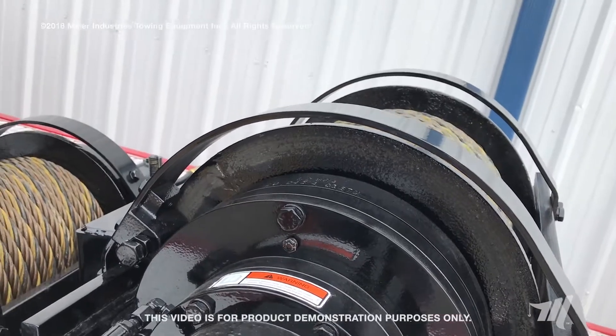Today we want to talk about the differences between the DP winch model 35 and the DP winch model 50s and how they operate internally. On the 35s, when you're in free spool mode, you're turning the gear sets through gear oil, so there's internal drag. On the model 50s, it's a total drum free spool — there's no internal drag — and therefore we have an external drag brake to help offset the lack of friction internally from the DP total drum free spool.